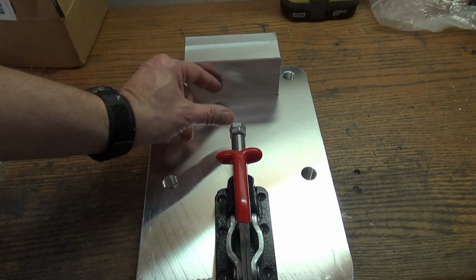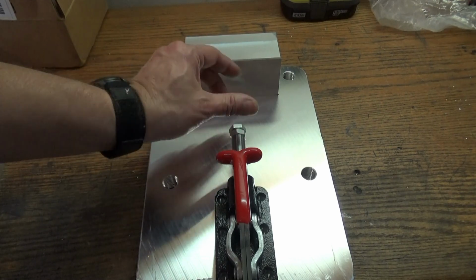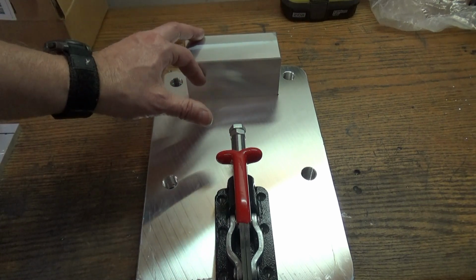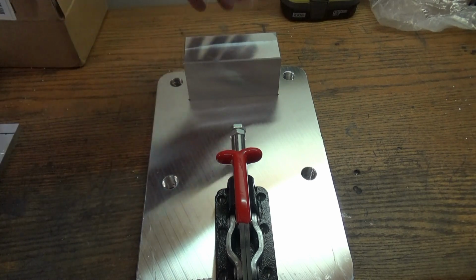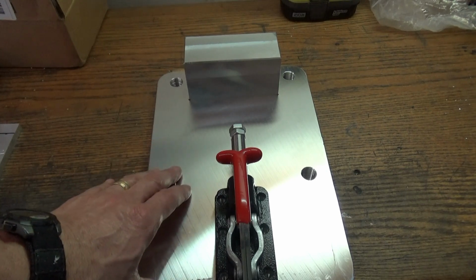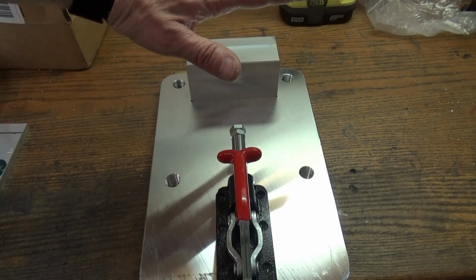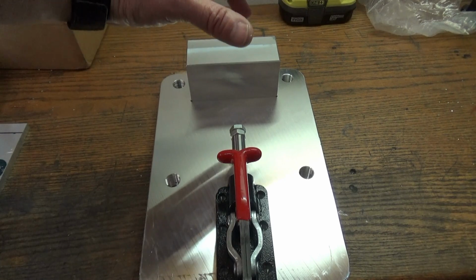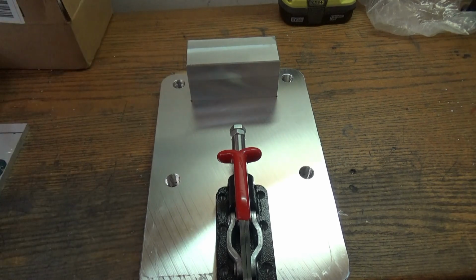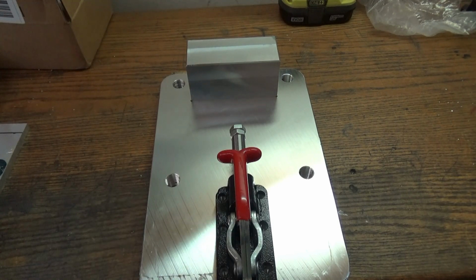When it's fully clamped, I've got a maximum of 3 inches, so I think that's going to be pretty good for an inch and a half per side for the mold. That'll cover just about everything I can think of at the moment. Next, we're going to start moving on to the next part, which is the mounting plate. This will hold the injection molding melting chamber and that center plate, and we're going to work on that next. Also, the mold chamber mount, we'll be working on that.